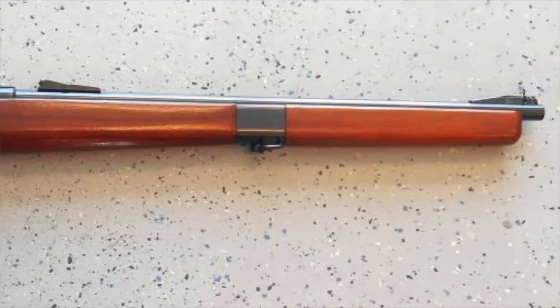This one happens to have varnish on it, so the first process will be nitromors to get the varnish off, then we'll go to sanding and staining. The beauty about our stain is it's a really thin, oil-based stain, not a thick, gloopy oil-based stain as you can get, but really thin. So from day one, it's soaking in and penetrating deep into the wood.